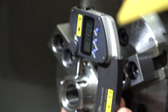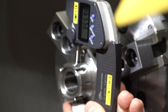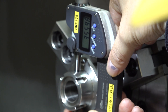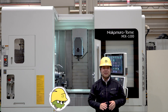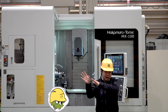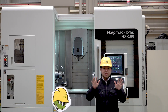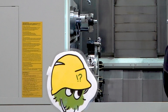Let's compare how much difference there is against the target number. Our target is 35.6. Just in case, I measure now — how much is it? 35.598. It's very close, almost perfect. We got a very good number here. As you can see, with OneTouch production, you get good parts from the first piece. What we are doing is simple: change the insert, input a slightly bigger offset, then semi-finish, measure, calculate the offset value again, and perform the finishing process. The machine automatically does this entire sequence for you — everything with just one-touch operation. It's so simple.